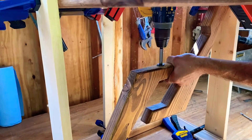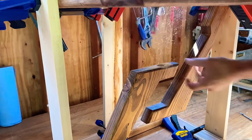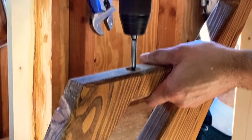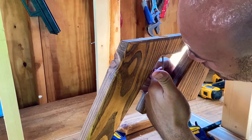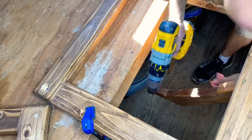Again using my one-inch Forstner bit I drilled down about three quarters of an inch, then took my three-eighths Forstner bit and drilled through the rest of the hole. I then dropped the nail through that hole so I could figure out exactly where the midpoint was on that second arm, made a mark, and drilled through that as well.